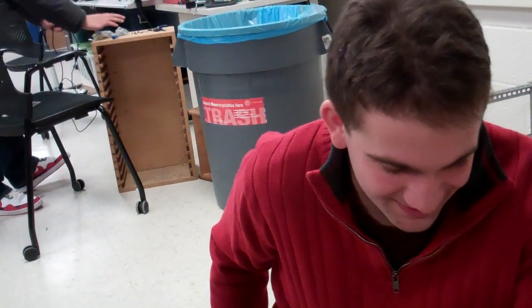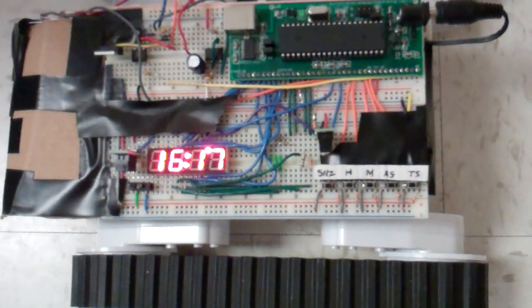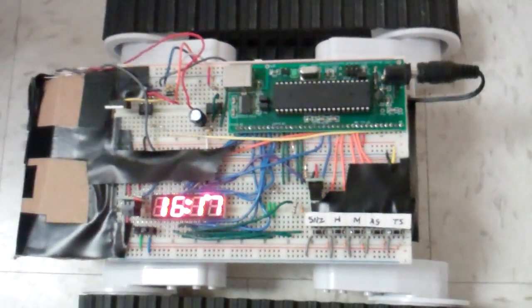The seven-segment display is interesting. This device only has 16 pins, but there are four digits, each with eight segments — seven plus the decimal point, which we're not using. It's multiplexed so the same eight pins control the segments on all digits. We wrote a software driver that drives only one digit at a time, cycling through them rapidly so it looks to our eyes like they're all on. It's a good illusion and plenty bright.